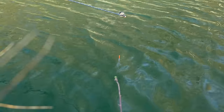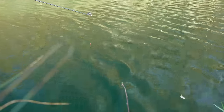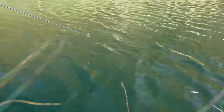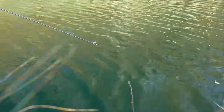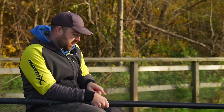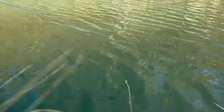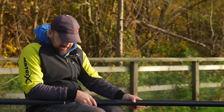Just to show you the difference — if I go six to eight inches past it and plumb up there, the whole float is sticking out of the water. Big difference. And if we reverse the other way, going slightly further back off the shelf, the float goes underwater by probably a float length. So you've got to be ridiculously accurate.